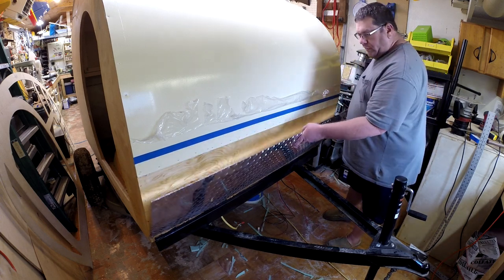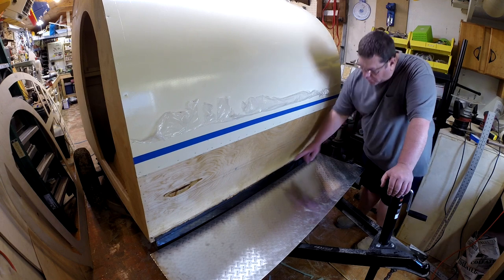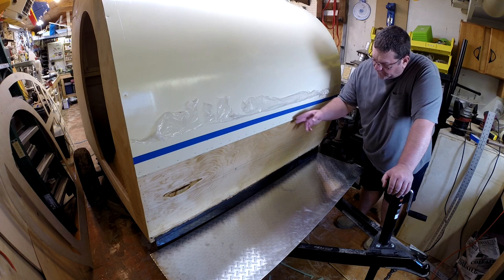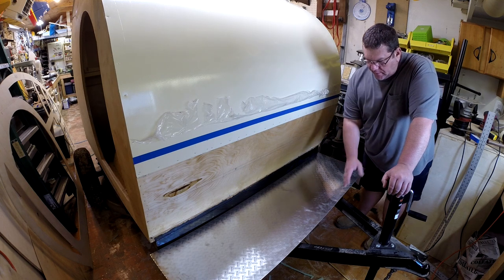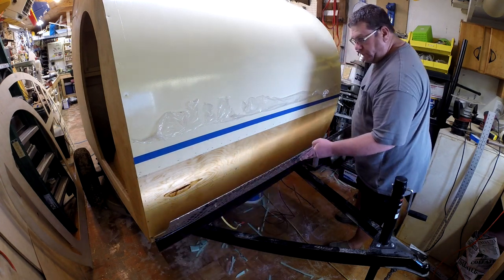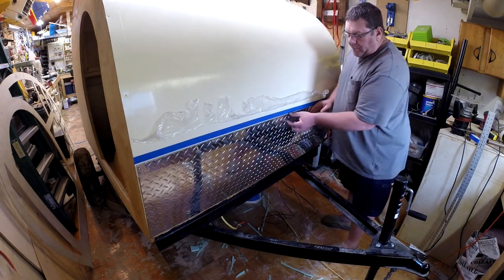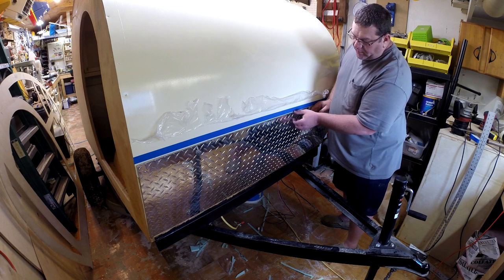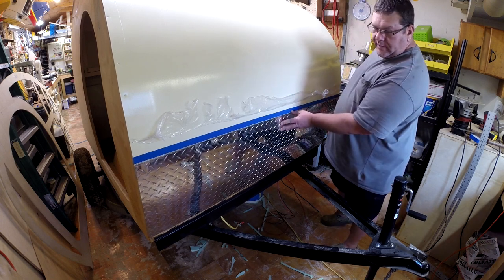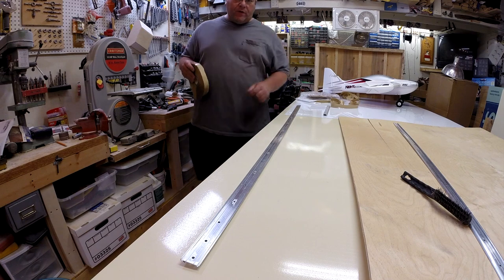What I'm going to do is put two beads of polyurethane caulk on the bottom edge of the plywood, put a couple here on the bottom edge of this skin, and then I'll put the skin on with some stainless steel sheet metal screws and some self-tapping screws. I'll be putting butyl tape underneath some aluminum trim here on top, so I hope this is going to be as easy as I think it's going to be — but we'll see. I'm using three-quarter inch butyl tape.